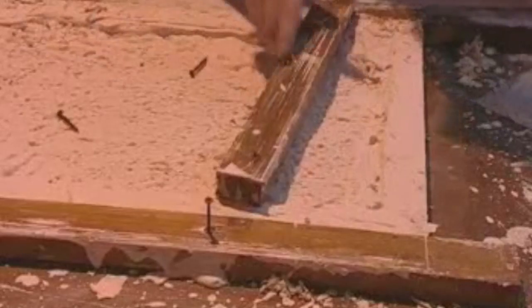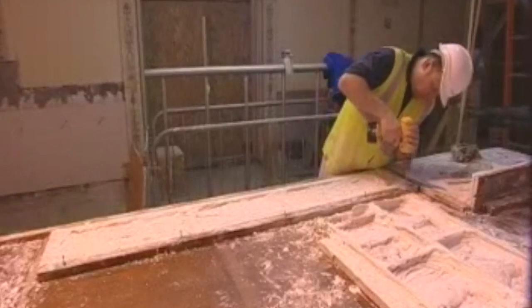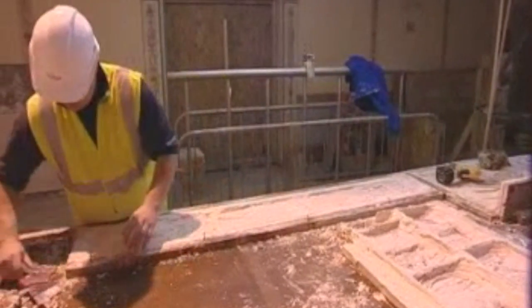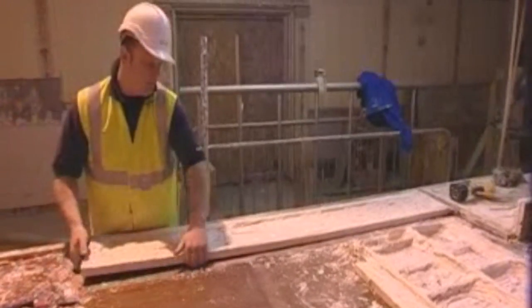When the plaster has fully set, the mould is dismantled, and because the timbers have been well greased, they come away easily. The plain face slab is now taken off the bench and the face cleaned of any imperfections by using a metal busk.